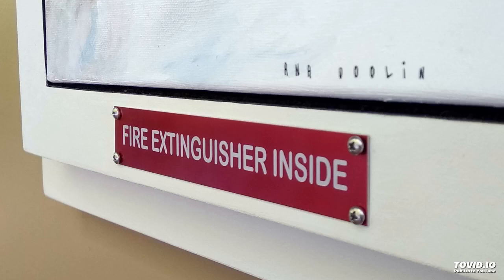I've placed masking tape on the approximate top and bottom of where I want the opening, but remember that the larger frame of the cabinet will extend almost 2 inches above, below, and on each side of the opening that you'll be making. So we'll place the stud finder on the wall, push the button, and slowly slide until the red light points at the edge of the stud. Now what we'll do is double check by sliding from the other side. The marks should be about 1.5 inches apart, if that is the stud.